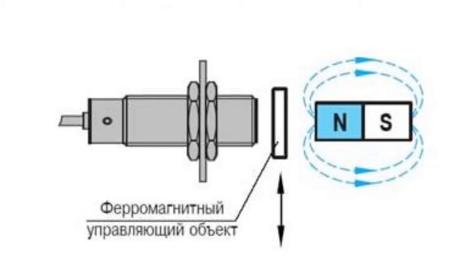The advantages of magnetic reed switches include the ability to work with alternating or constant voltage up to 300 volts, a low — approximately zero — voltage drop, and the simplicity of design. The advantages of the second group of switches include longer operational life.